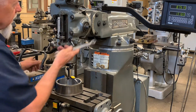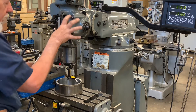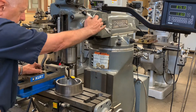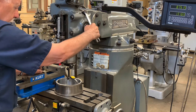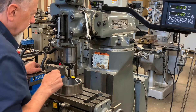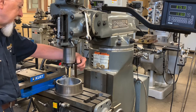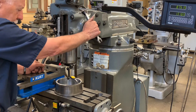This screw right here is like a worm gear. As you turn it in, there's a gear on the back of the head and it will rotate to turn the head. So I will just gently and very easily turn this until that indicator tries to go backwards. I have no earthly idea which way to go until I start moving it — I just move it and see what happens. I'm not trying to shoot for a number. I'm just trying to make sure whatever it is on the right, it will be the same on the left.